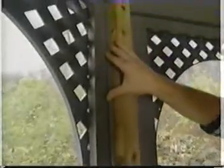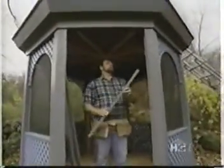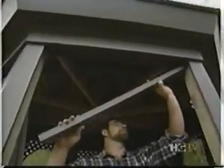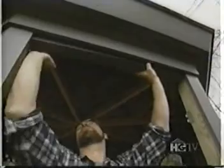And it'll be held in place with nothing more than a piece of 1/2-inch quarter round, which is secured with some 1-inch brads. Well, now for the door. The door will be in-swinging, but I have to set some stops up against it, which it'll close. So there's a piece of 5/4 pine that gets set up at the top.